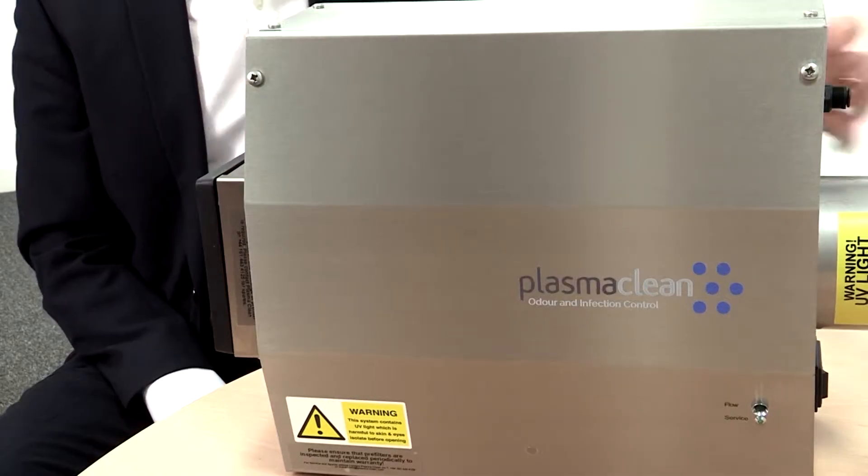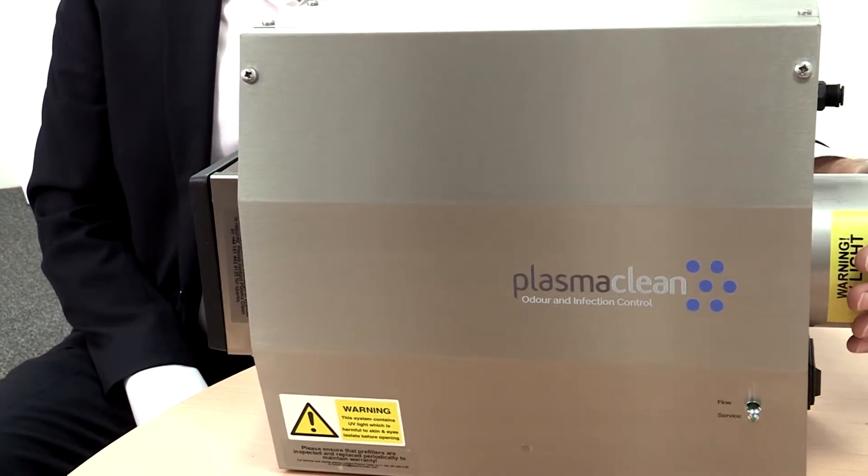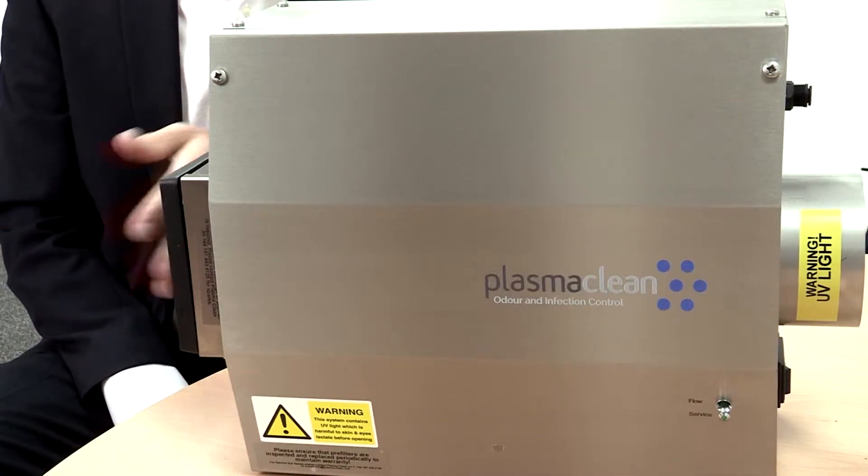This is the X-Track 2100, an ozone injection unit designed to be connected to the ductwork after the canopy. The main system fan pulls air into the unit where it's pre-filtered. Ozone is generated inside the unit and released into the main ductwork, where it attacks the odour in the air and any grease which lands on the duct surface. Its main function is for odour control.